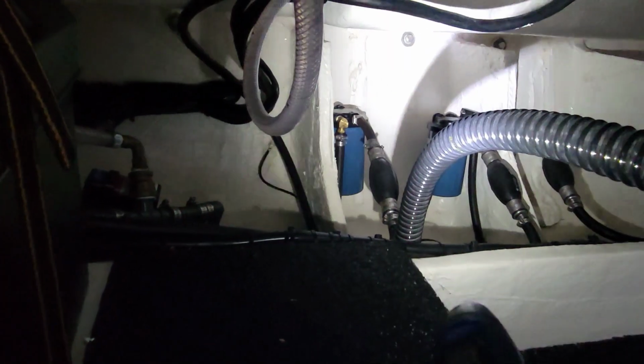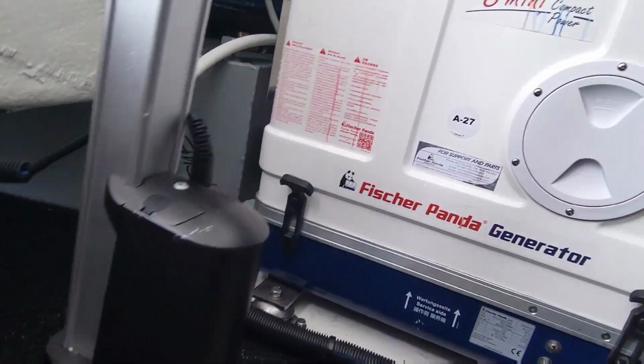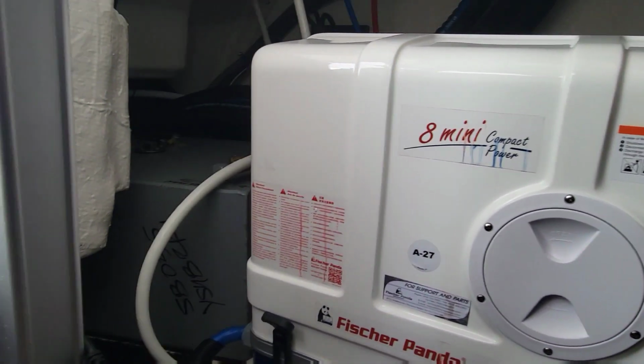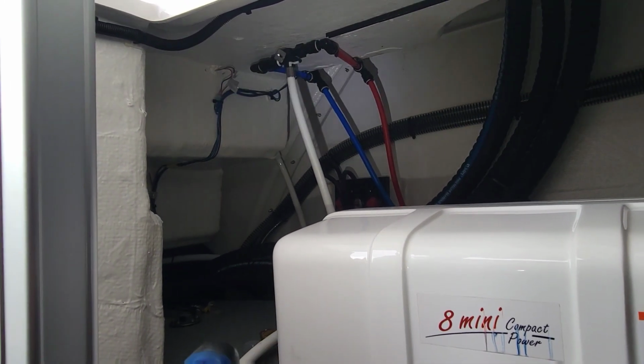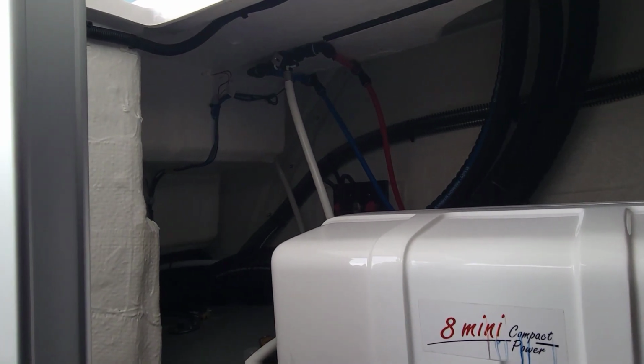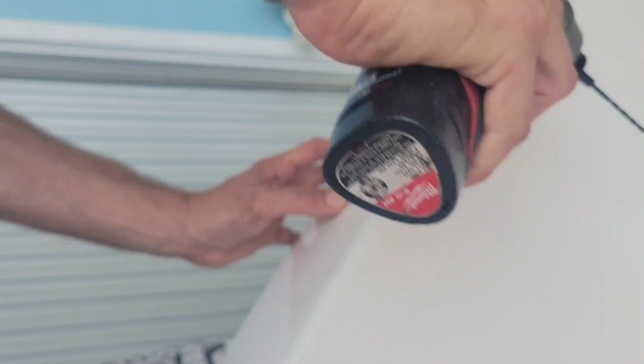And since I did the service, I also got to change our fuel water separators out. I've already finished the motors. Now we got to test run them. I'm also going to have to prime the generator here and test run this after we get fuel in it, after I hook our hose up here. So let's start with hooking our hose up. Do that first. There's also one other thing on this boat, which is just the wireless charger on the dash. We'll get to later.